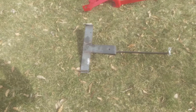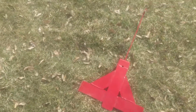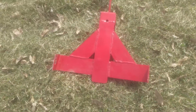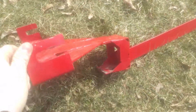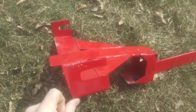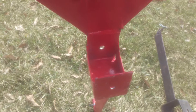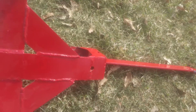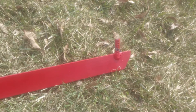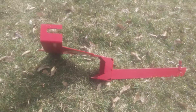The painted one is our first adaptation — prototype, you could say. We made it in the shop out of 1/8 inch steel. This part here would go where the draw bar of the tractor goes, and then this C-part would be where your wagon hooks up. This would sit up on the transmission. That pin there will hook up just like your normal implement — your disc plow, etc.